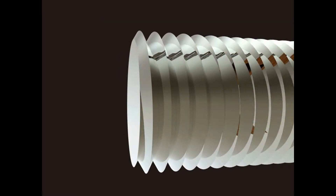This next piece is probably our most important — it's what actually enables our drive system to move up and down. Here's a blow-up shot of what it looks like. On our drive shaft, it is a half-inch drive shaft rod. What is most important is the actual dimension between the tips of our teeth. The software we are designing for is regulated according to a two millimeter offset — meaning from the sharp point of one tooth to the sharp point of the other tooth is two millimeters in dimension. We'll cover that again when putting it together in real life.